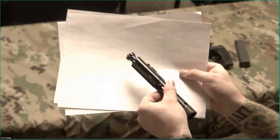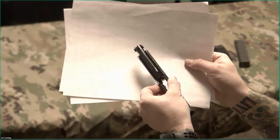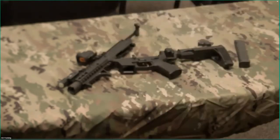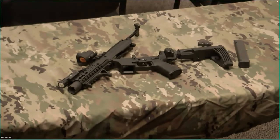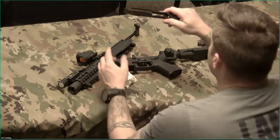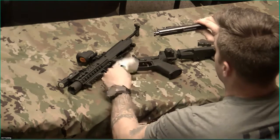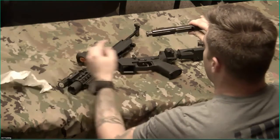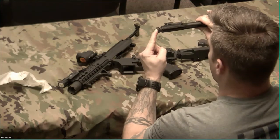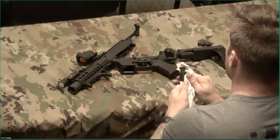But on the back of the bolt, you'll see that where this engages with the chamber, there are 45 degree radius. The back of the bolt is sort of radiused at about 45 degrees. And what that's doing is it's engaging when the weapon cycles, and this is pulling back out of the system. You'll see that this is sprung. There's a spring in there. And so the back end of this being angled is delaying that. This is going to have to move in the carrier before the carrier can move back. So that's hence the term radial delayed blowback.